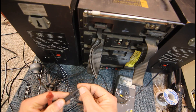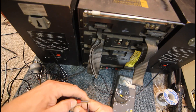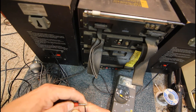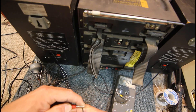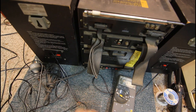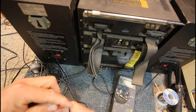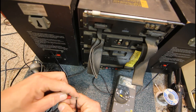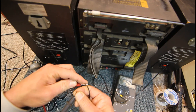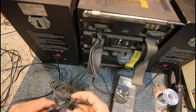We've got our multimeter set to ohms. We'll get one of these speaker wires and measure across it — these are probably down around the four-ohm mark. Rated at 6 ohm impedance, 38 watts nominal, 76 max, so they're quite powerful little speakers. That's measuring around five ohms which I think is okay. The other channel is also measuring 4.95 ohms around there. At least they're not shorted out.